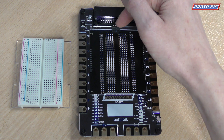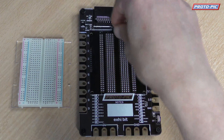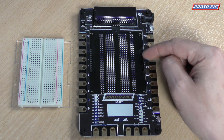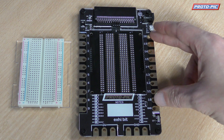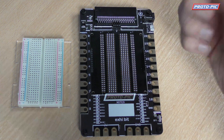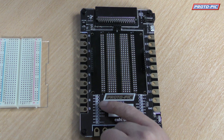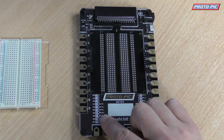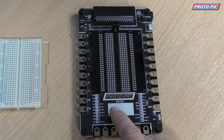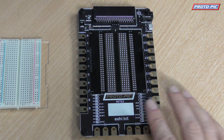You've got four headers here — two of them are ground and the other two are 3 volts — and that's for hooking up your power and ground rails on your breadboard. And you've got 10 pins here and 10 pins there, and these are exactly the same as here. So you can hook, say, pin 16 to an LDR, for example, over here on your breadboard. You've got the pin-out here on the silkscreen, so it tells you what each pin is, and it also tells you if it's LED column 1, 2, or button A or button B, so you know if it's used for something else as well.